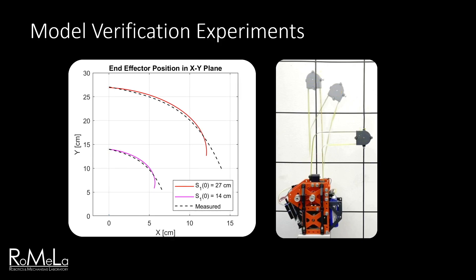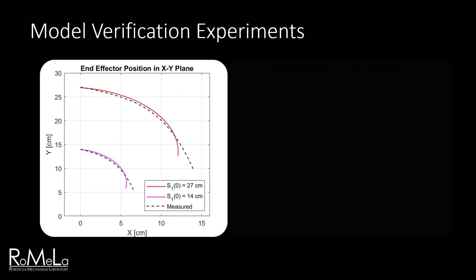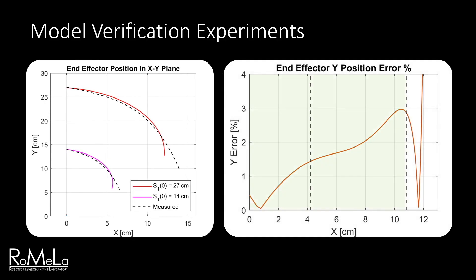For multiple trials, these graphs show the average trend lines for the measured data as dotted lines, with solid lines showing the model's prediction. The simplified model appears to track well for angular displacements between 0 and 70 degrees, only deviating up to 3%. Beyond this point, the tape's sudden transition into a fully folded state causes the fold to migrate slightly, and the end effector travels along a different path than expected since the pivot point is no longer at the midpoint of the limb. In addition, gravity causes the end effector to sag slightly below the expected position at all times. In ongoing work, we are forming a more complete model of the limb's bending behavior, using numerical or analytical methods to characterize the large initial deflection, and integrating other theories to characterize its folded bending stiffness and rotation properties.